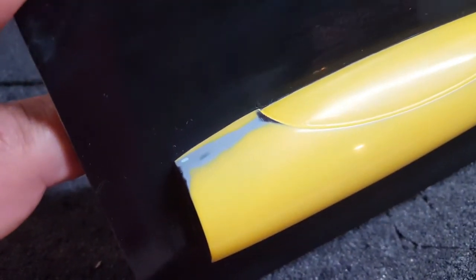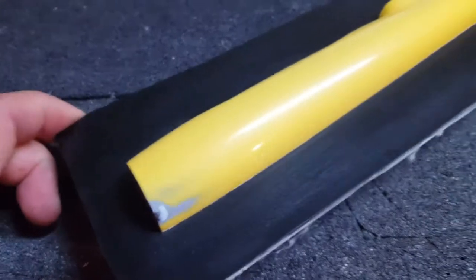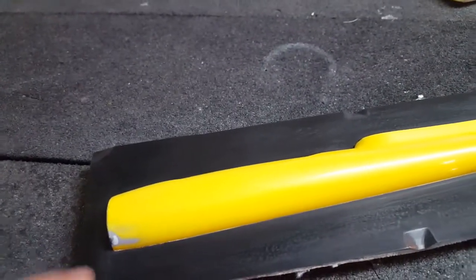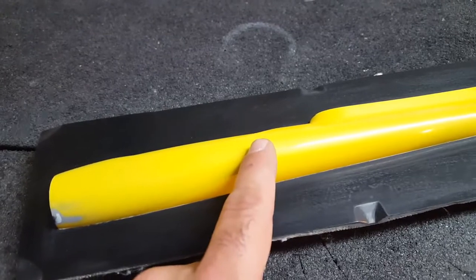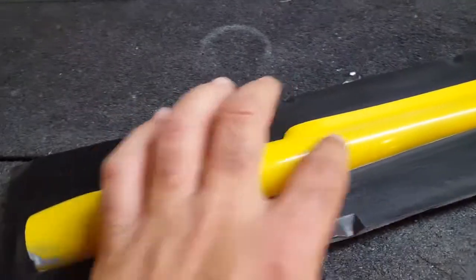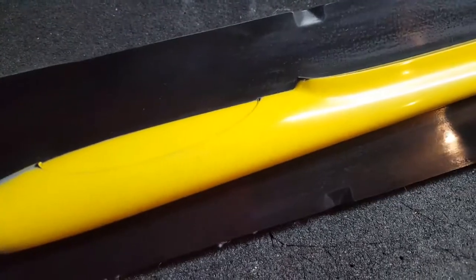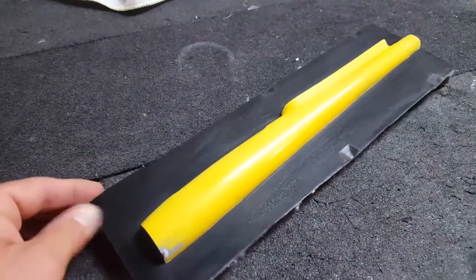You can see there's primer and some of the plastic exposed, but I wet sanded it and polished it so it should be okay — and I can polish the mold out too if I need to. I cleaned up the little index marks, wet sanded those up to 1500 grit, and did a little bit of sanding and polishing on the mold face. I hit it again with 1500 wet sandpaper and polished it out again. I had a few little nicks and marks from just handling it, again because the paint is so soft. So I'm going to put another coat of sealer on this, then hit it with some mold release and set it up to make the other half of the mold.